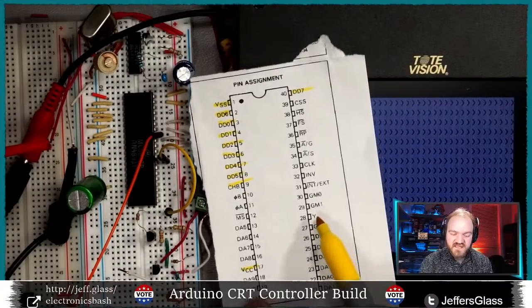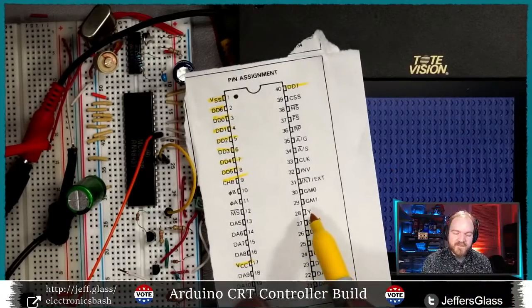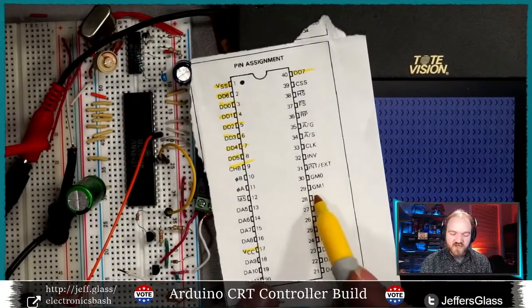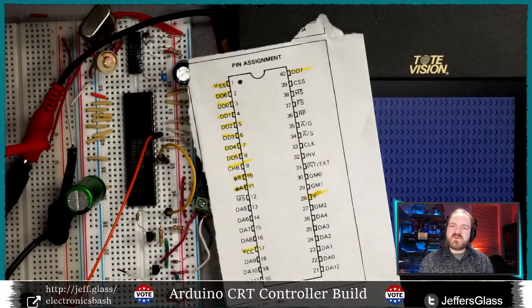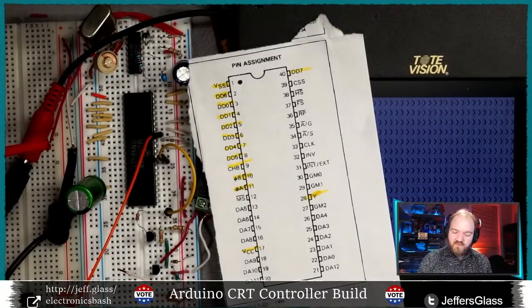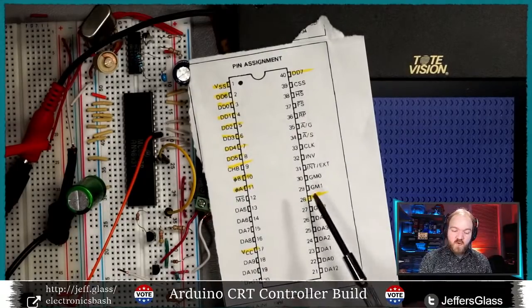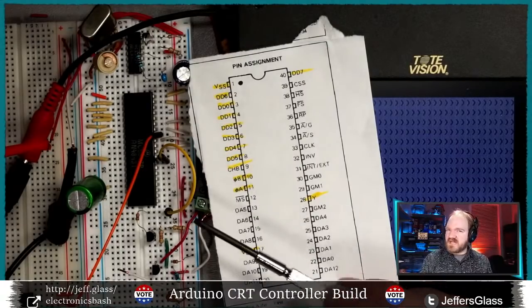The Y pin here is the luminance output. And this is worth noting. This is one thing I've sort of bodged around for now. This device outputs video not straight to the screen, but in 3 separate components, which are Y, phi A, and phi B. If you know anything about composite video, you will know that a standard broadcast television signal, at least back when they were composite, right now they've been digitized in the past few years, would be output as a black and white signal in terms of intensity with an additional signal that communicates color more or less buried within that same signal.